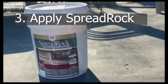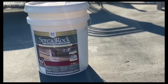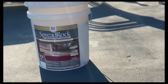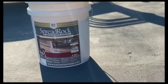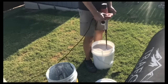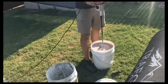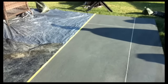The next step is to apply the spread rock. It's a very unique material — it's not paint. It's very fine granite mixed with a very sticky substance. This is water-based, but it's really hard to get off your hands. The first thing you need to do is mix it thoroughly. I use my Harbor Freight concrete mixer — I love that thing; it mixes paint and concrete and other things, and it's very heavy duty. See the affiliate link below for this. I also chose to experiment on the far end of the patio to develop my technique. I'll show you how to lay the grout tape later in this video.